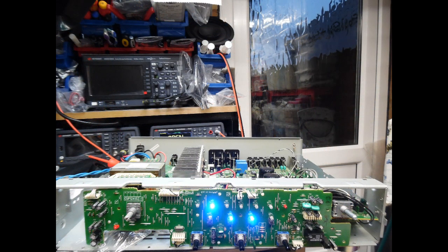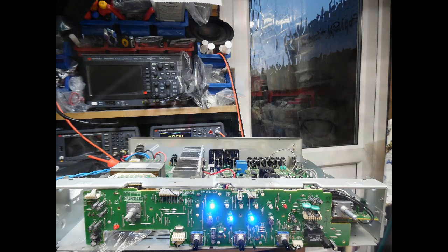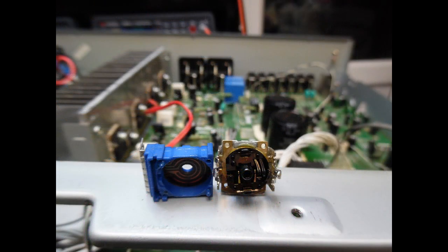For test purposes, as shown in the video, I leave the board in place — just be careful not to short anything against the metal chassis. Using the service manual schematic, which is available and downloadable and shown in the repair video, I followed the circuit diagram and checked the signal as it enters the balance control potentiometer.